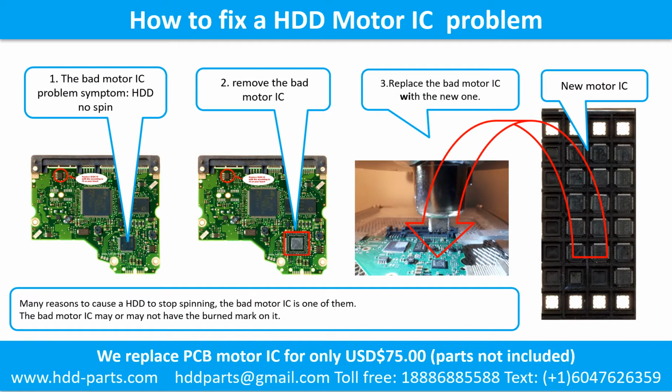How to fix a hard drive motor IC problem. 1. The bad motor IC problem. Symptom: the hard drive does not spin. There are many reasons to cause a hard drive to stop spinning. The bad motor IC is one of them. The bad motor IC may or may not have the burned mark on it.